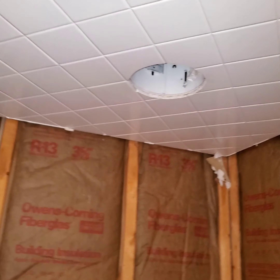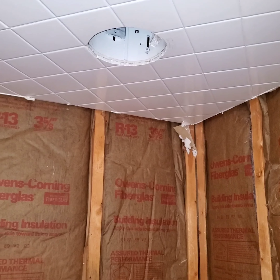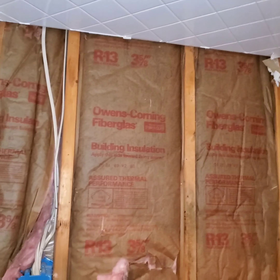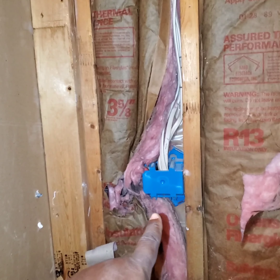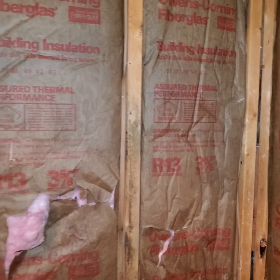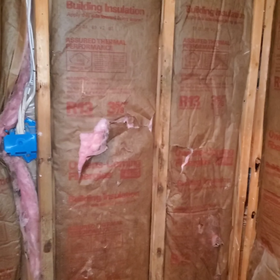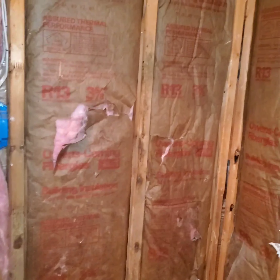I don't want to put a rain shower in here with it being right on top of your head — it needs to have some distance to fall. I may go all the way up to the current ceiling. Either way, this is going to get raised and I'm going to have to reconfigure this — probably move it either over to this side or up a foot — because I want a wall-to-wall niche. I'm going to put a niche right there with a light in it and everything, so I have to do a little bit of reframing here.